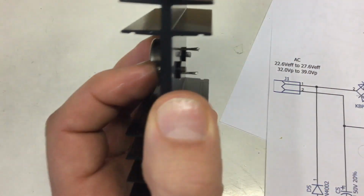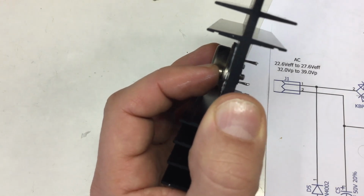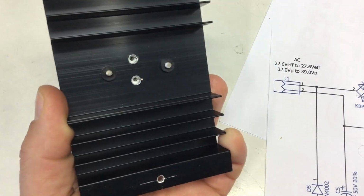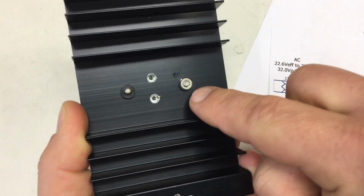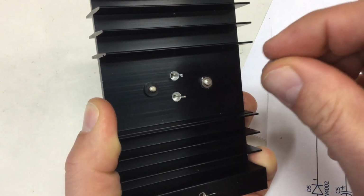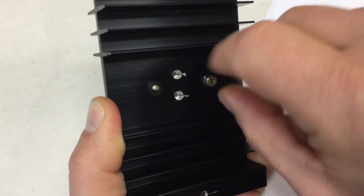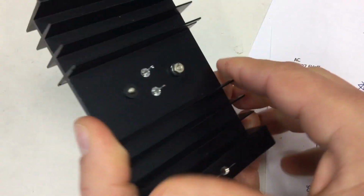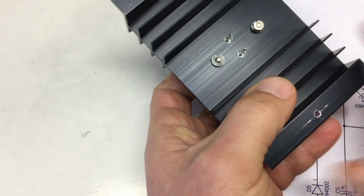Then on the other side, ooh, these screws are a little bit short, are they? Let's put at least one on loosely. On the other side, you need washers when you use isolation pins, because having a metal nut torque down on a plastic isolation pin is probably not a good idea. And I'm just making this hand tight, and I have to look. Let's see if that's enough.